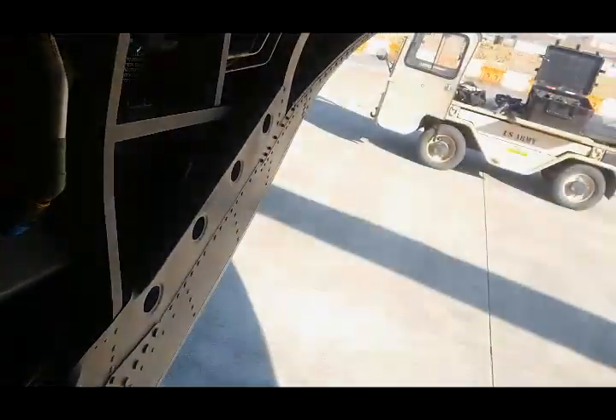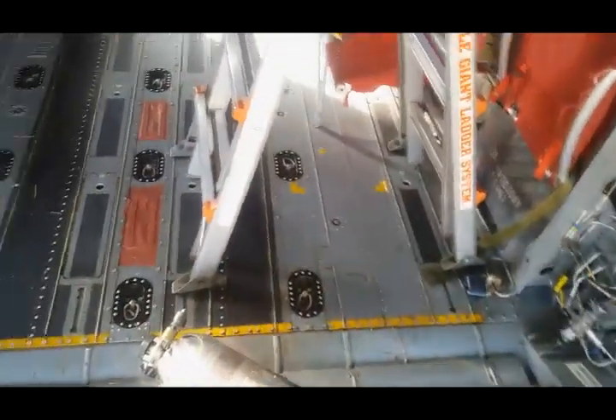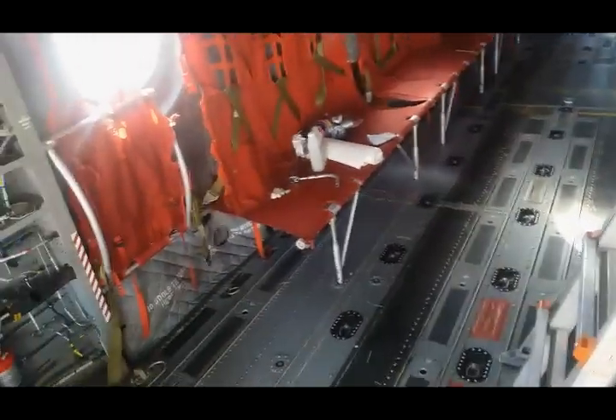I noticed when I try and start it, the start module dumps all its pressure. You see it's sitting at about 400 psi right now — it was at 1400 — that means it's leaking somewhere. So what you're going to do is service it with the nitro bottle, spray a little soapy water on it, and see where it's leaking.